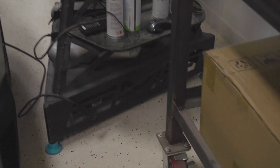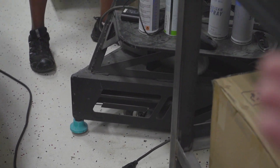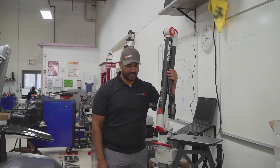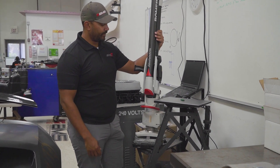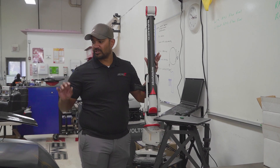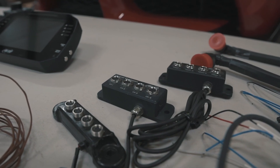One really cool thing — as you can see what he's doing right now, the scanner is on air jacks, not air suspension. There are two tanks in there and a steel base. We built this — it was kind of a generation before me — but it makes it really easy to get this thing around the shop. When you're scanning, you want this to not move. The software assumes that your work piece is fixed in space, so if either one moves and you don't know exactly how, you have to start over.